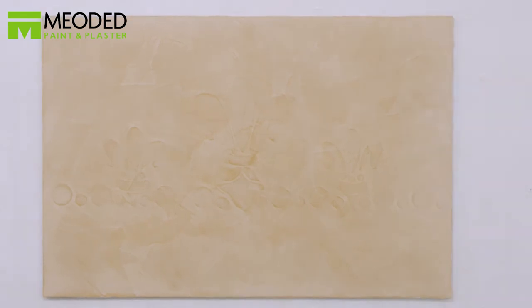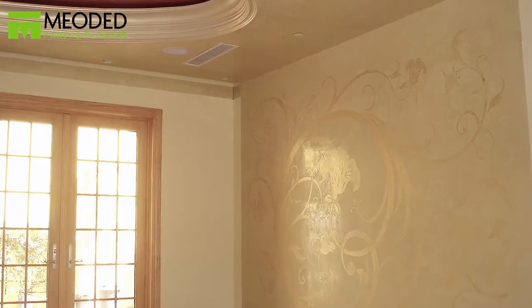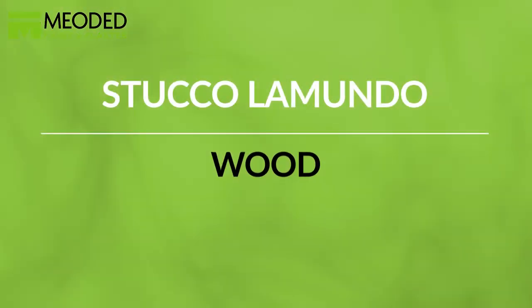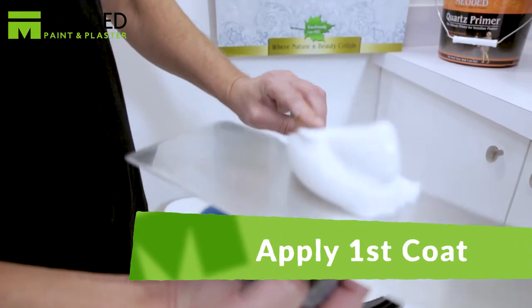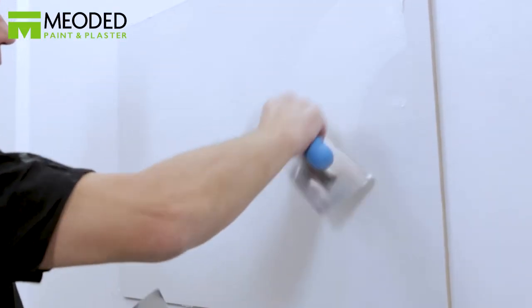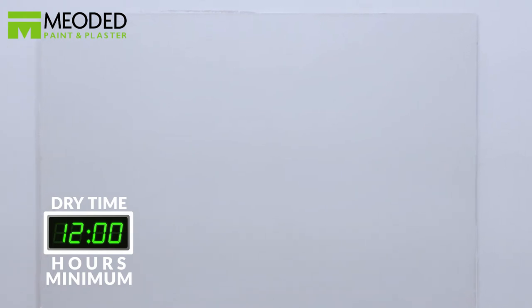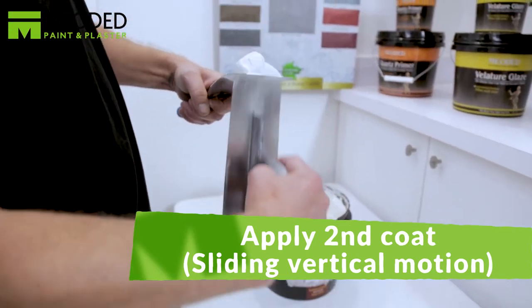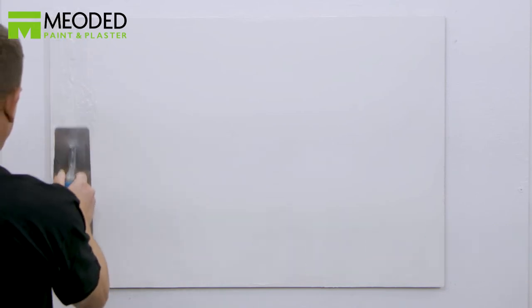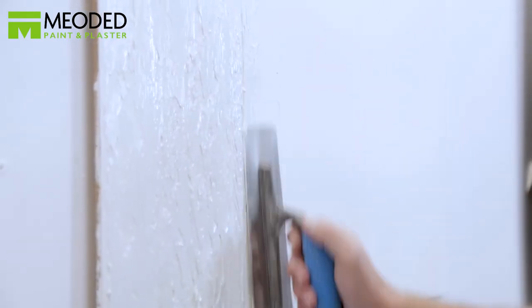Stucco LaMundo stencil provides a delicate design with a rich and beautiful finish for your treasured interior rooms. The third option is the stunning Stucco LaMundo wood effect. Follow the steps of the Stucco LaMundo regular for applying primer, then apply the first coat of Stucco LaMundo, creating a very thin, even coat with the trowel. Allow a minimum of 12 hours to dry. Next, using the trowel and putty knife, put material on the trowel and slowly apply it in a sliding vertical motion, creating a very thick and rough texture. Continue to scrape the trowel with a putty knife, placing it like a glob on the trowel, and repeat the application until you've covered the entire desired surface.